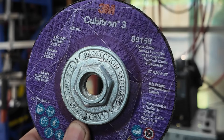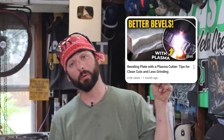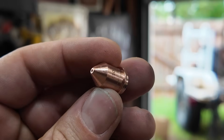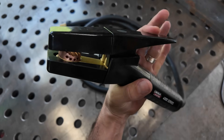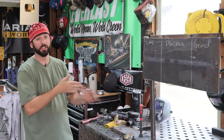We're going to use that cut and grind today — so again, it could do both. Then we're going to switch over to the plasma cutter. If you remember the video we did a while back on beveling with the plasma cutter, we used this Radnor 45 amp plasma cutter and it came with some gouge tips. After that, we're going to switch to the big mama jamma of them all: the carbon arc cutting, or carbon arc gouging process. We'll go over the size of machine you might need, including a smaller machine.